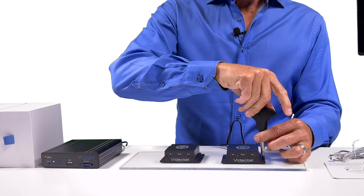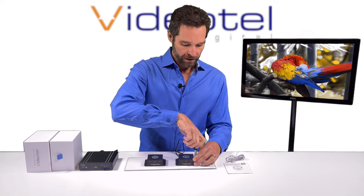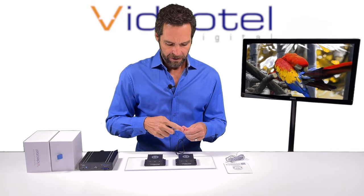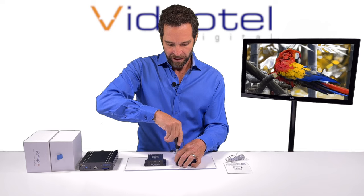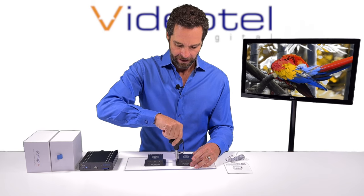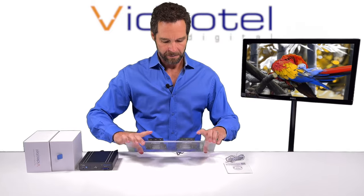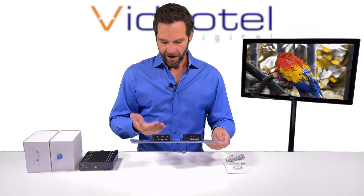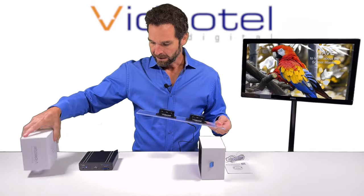As for materials, you can pretty much use anything that's not metallic — plastics, formica, wood — pretty much anything that won't block the signal. The only things you don't want around it are metal and wires. As you're connecting this and figuring out the display, make sure the wires aren't running behind the unit because that will interfere with it. The sensor is on one labeled side but it will also sense on the other side, so if it's too close to another object or you have wires on the back, it could give you some false triggers.